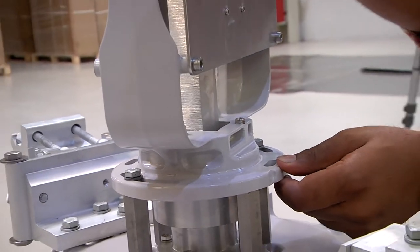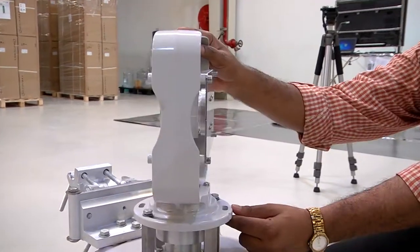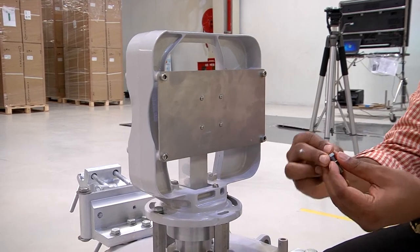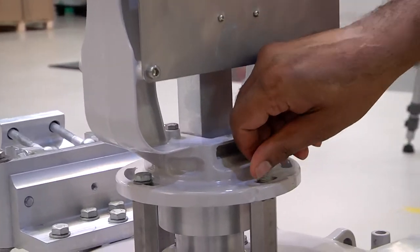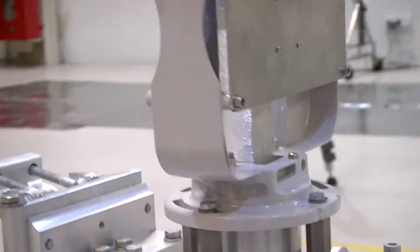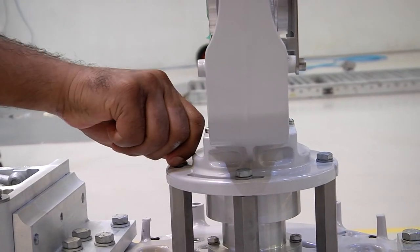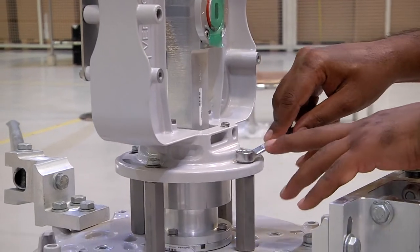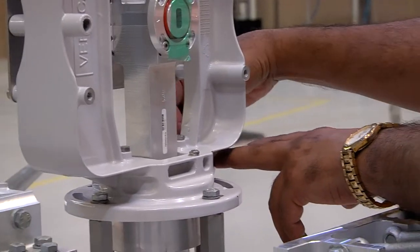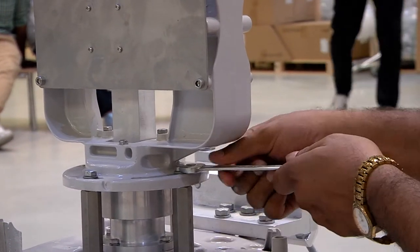Once this is done, the OMT radio interface unit is turned back to the same position, and two more pieces of M8x25 screws with washers are attached to the distance screws, as is being demonstrated. Once this is done, all the polarization screws must be tightened with a 24 Newton meter torque, and all the M6x50 screws must be tightened with a 7 Newton meter torque, as is shown in the instruction manual.